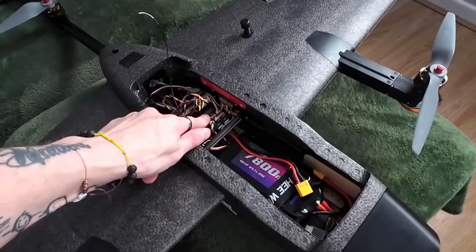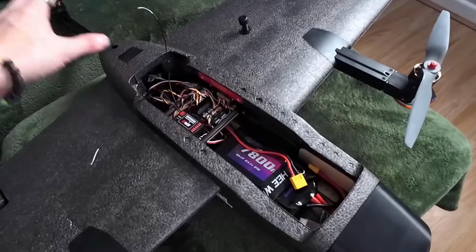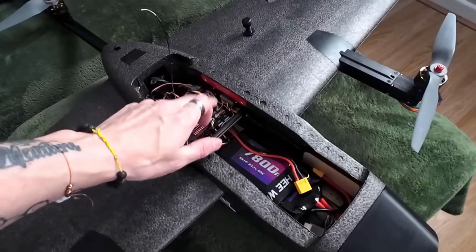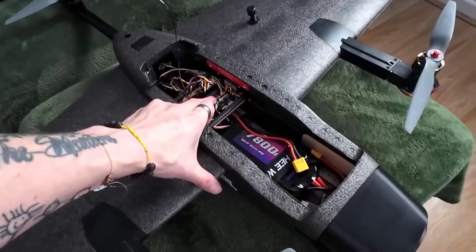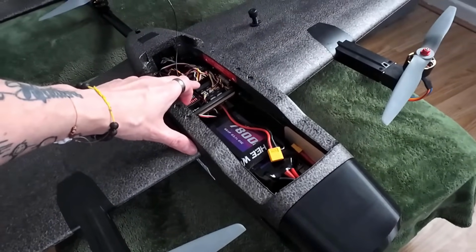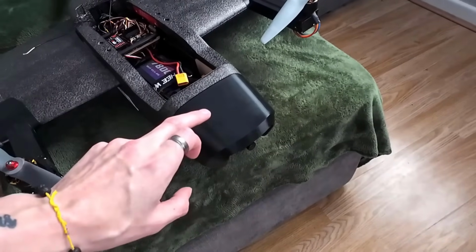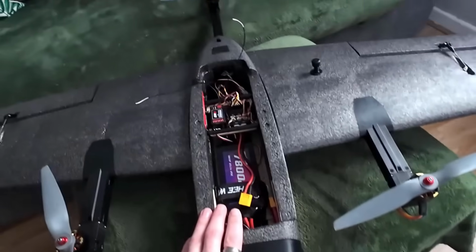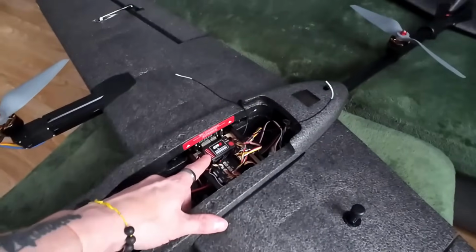All of them are occupied by the various flight control surfaces on the aircraft, so you don't have any spare. The reason why that's problematic, hopefully you can work out what I'm getting at, is that if there are no spare PWM outputs on the flight controller, how do you control the tilt servo in the front? Well, what I ended up doing was buying this guy here.